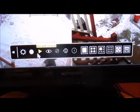It takes you back to the main screen - I leave mine on the quad. Get your thumb drive. Like I said, don't put it in the front - put it in the back. I'm putting it right above where the mouse is on the back. Then you come back to the screen, right-click to get the little bar, right-click on the little bar, and go to Record Search.